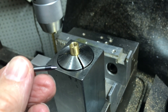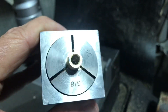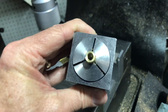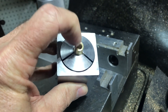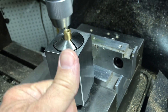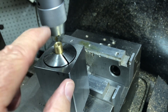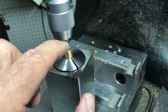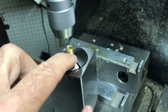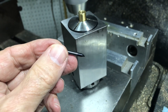Next thing in the final step will be to get a sharp chisel type device and make some nicks at the top so the ball can't seat against the top. Now I'm holding the upper housing in a 3/8 inch 5C collet chuck. I'm going to put it in the vise and use a piece of tool steel — looks like a broken tap that I almost ground down years ago. It makes a nice chisel, as the book calls for. The point is just to make several disruptions or nicks around the base there so that the ball can't get sucked back in and create a vacuum the other way. The only way you want it to seal is when there's steam coming out — it'll blow the ball shut against the bottom — and then when the steam comes off, to prevent a vacuum from being created in the cylinders, the ball comes back and rests against that top part as fresh air comes in, but you want a little space there so fresh air can continue to come in, and that's the purpose of the nicks at the base of the hole.